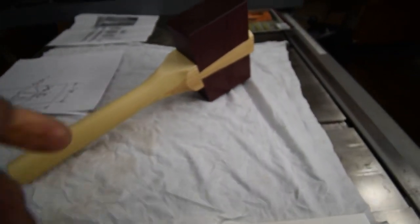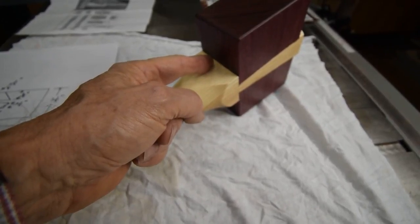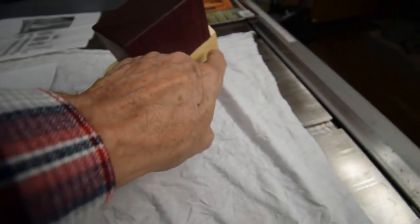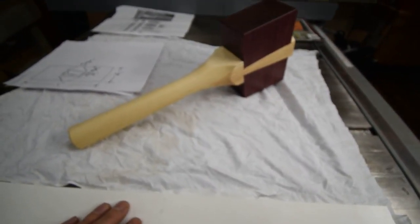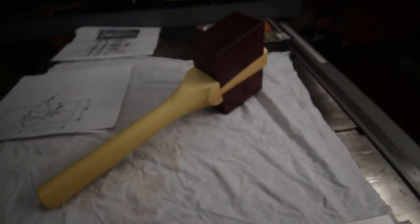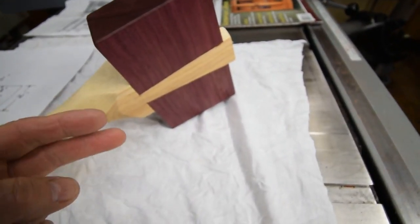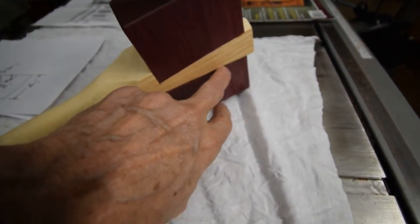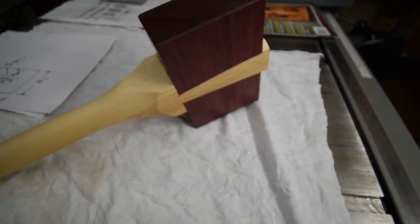What I should have done was the bottom of my tenon, as you know, was 3/4 of an inch thick. Had I gone 15/16, just 1/16 away from the center tenon, I could have had 5/8, 1 1/4, which would have been very much the same design element. So you decide how you want to handle it. By having the two different angles and having to cut that little notch, it really wasn't as bad a thing as I thought, because the edges of my dovetail rode on that secondary ledge I cut and stopped it from damaging the edge of my dovetail on the way up. So it wasn't a terrible thing in all ways.